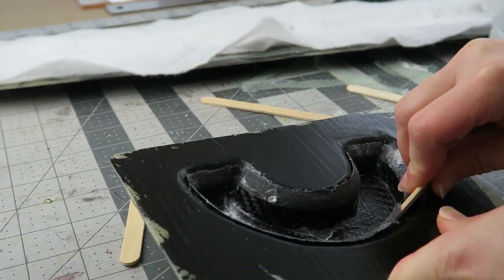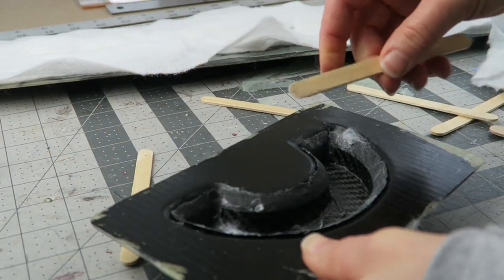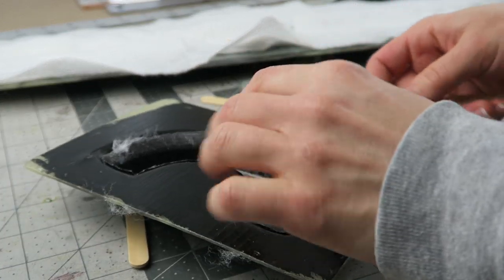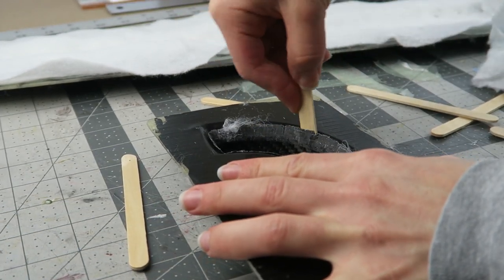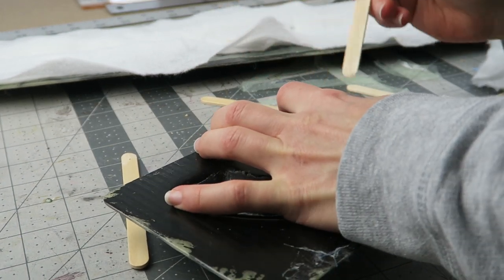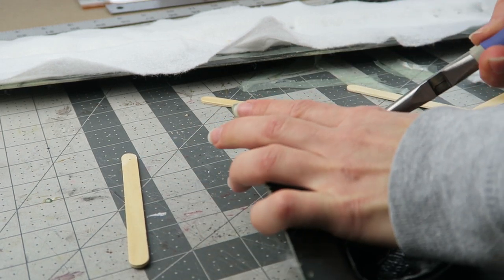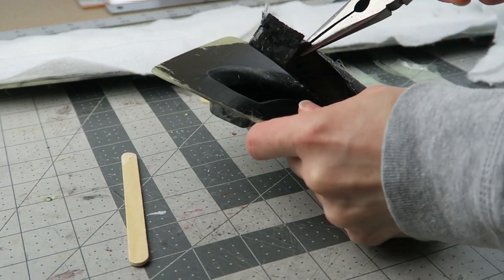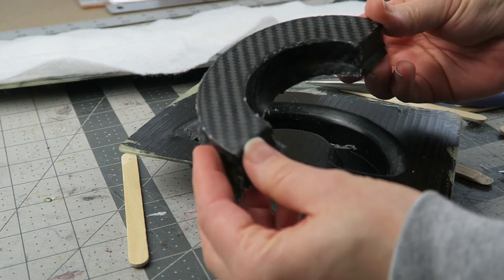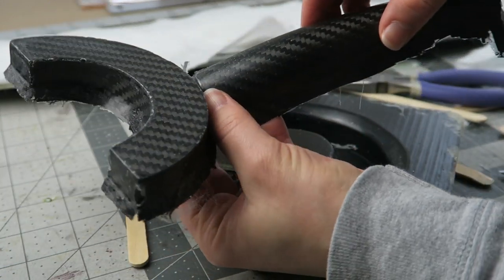The cross piece in particular took a bit of work to get it to release, simply because the part that the mold was created from had completely 90-degree angles instead of a draft angle. That was the trade-off from using an existing part versus designing this specifically for creating a carbon fiber version. I just had to release all the edges and then grab onto some of that extra material so that it could be pulled out. Because the angles are all 90 degrees, trying to get carbon fiber into that angle just leaves some areas that aren't going to be perfectly resin filled and the cloth won't reach, so that will just be repaired later on — no big deal.